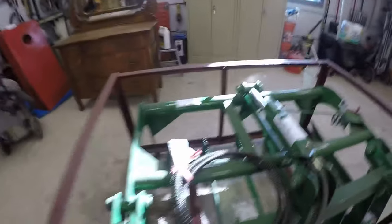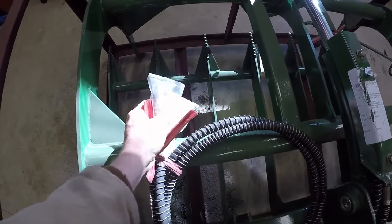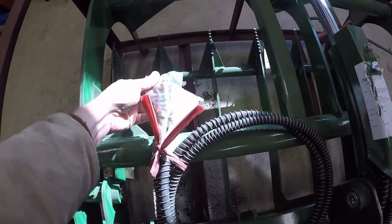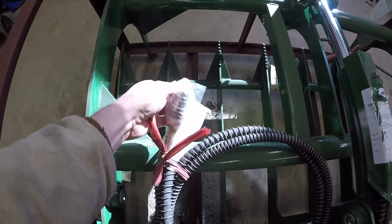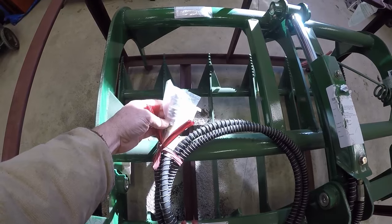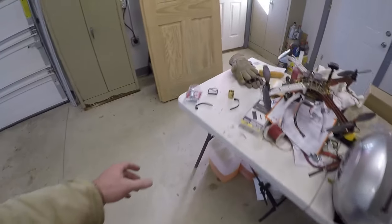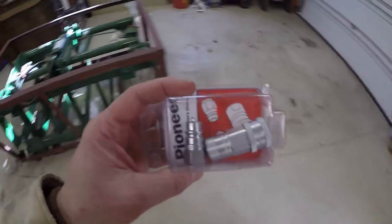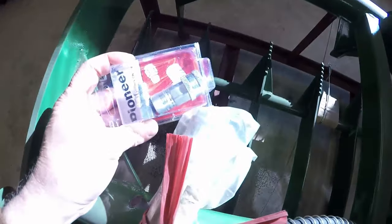They talked about these connections — these are the half inch or three quarter inch connections, the kind that would hook onto the back of the ports I have on there. But when you get the John Deere kit for your loader, those are actually three eighths. I've got Pioneer fittings and they're just a little bit smaller, where these are the regular size bigger ones.